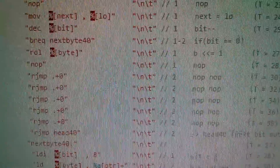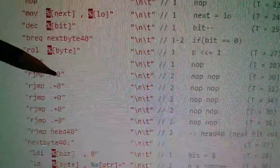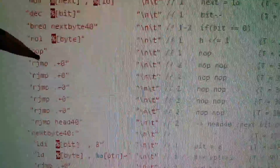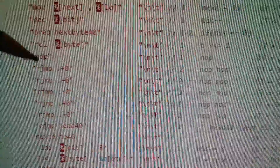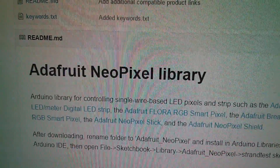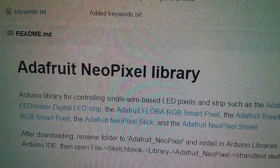Some of these timing sections are quite interesting. You've got a NOOP instruction there and they call it in the comments NOOP. Then there are relative jumps of zero distance — it doesn't actually jump anywhere. The reason they use them is because a relative jump in ATmega328 assembly language takes two clock cycles, so it behaves as two NOOPs. It's a way of writing NOOP twice without using two bytes of program code. The fact is that this Adafruit NeoPixel library exists, so it should be relatively simple to drive these individual RGB LEDs.